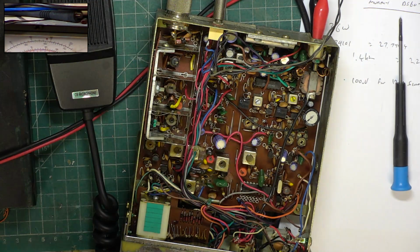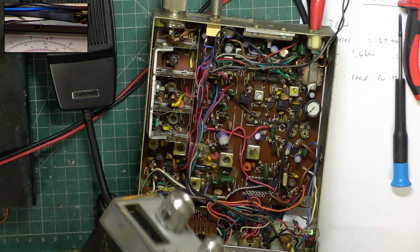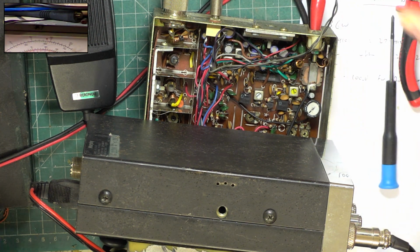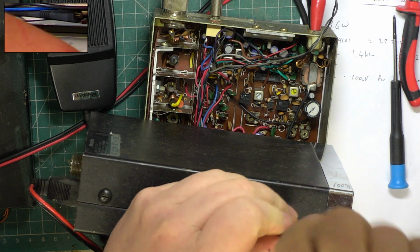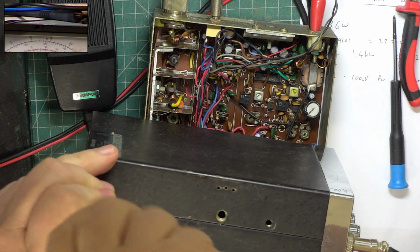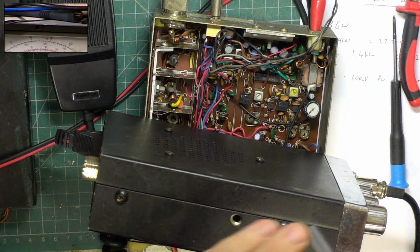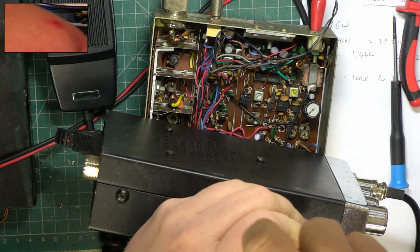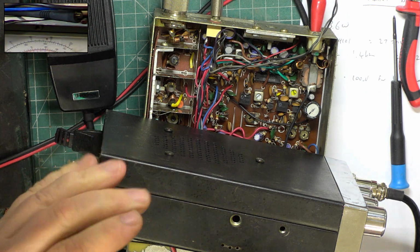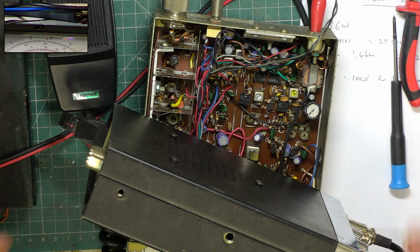So I've gone into stores, I've dug out our demonstration Murphy DS602. And this is the trouble you have to go to, because somebody has altered the set. And this has come in, remember it was S9 equivalent signal to get 12 dB SINAD. We've got it down to, what did I say, about 1.6. And it is acceptable, but I know these can often work better than that. So I've got to try, got to clutch at every straw possible.